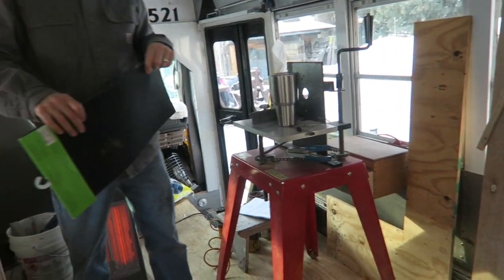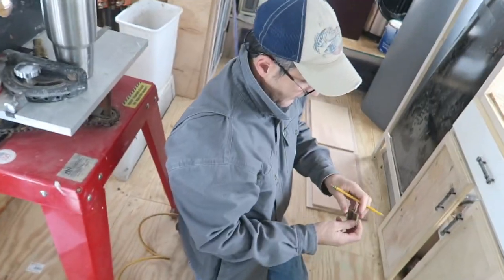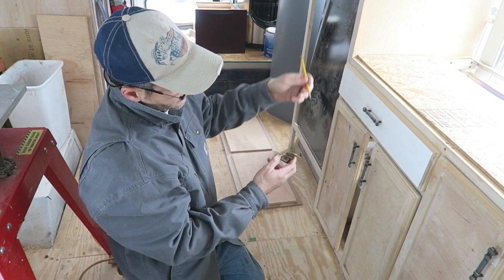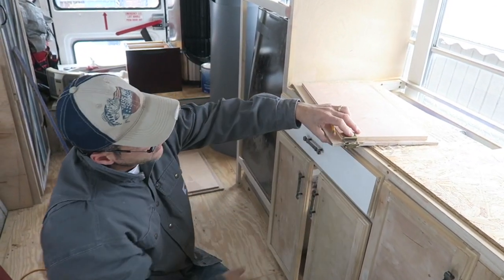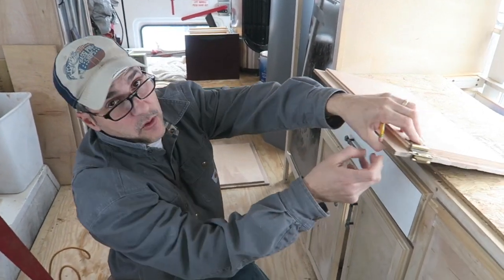You'd have to be over here. Oh, we're gonna have to router these hinges in. This here is supposed to be 3/8 thick. My wood is a 1/2 inch. So this has to get recessed into the back of the door, because they don't make a hinge. Maybe I can get away with just doing this. See, this is supposed to sit tight.